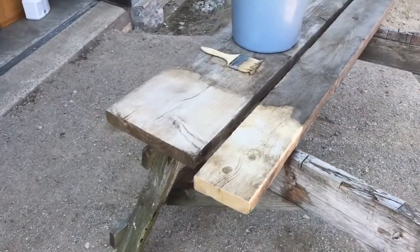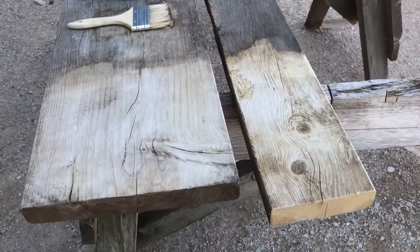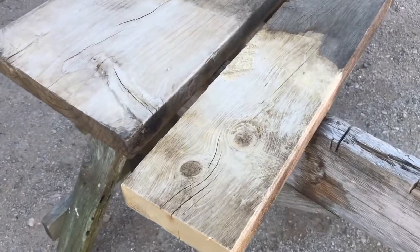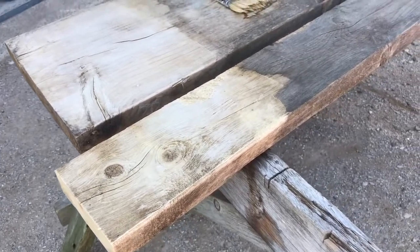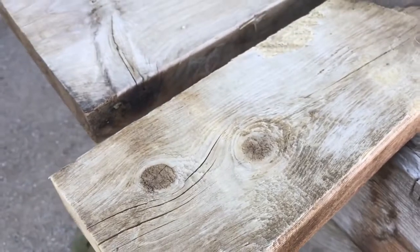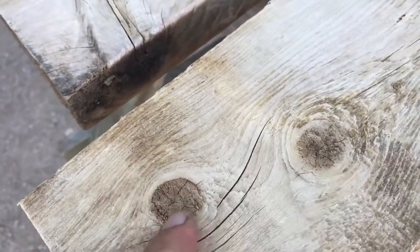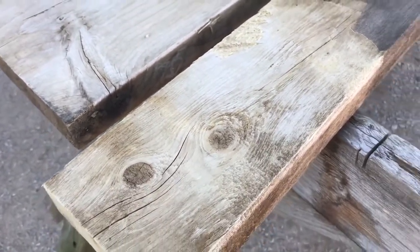Here you can see the results. Earlier in the video it was morning when I brushed this stuff on, and I've left it all morning long — it's now after lunch. I've been going about my business and come back, and this is the result. There's no scrubbing here; this is just the natural reaction of the Dual Blast to this gray weathered wood. There's still a little bit of discoloration, but it's mostly gone. You'll see that the knots still retain their color and you can still see the wood grain, which is not something you see with bleach — it just makes everything a whole lot lighter in a bland sort of way.